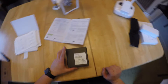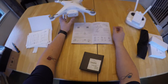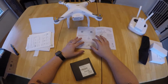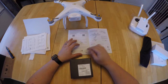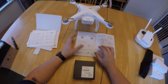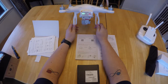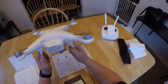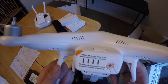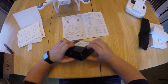Reading through the directions, like with all things, nothing comes fully charged — that's for the safety of the batteries. When batteries are fully charged they tend to swell when stored or in transport, going through different altitudes and temperature ranges — they're just not safe that way. It's better to have them at about 40 percent charge, which looks like that's pretty much where this one is.